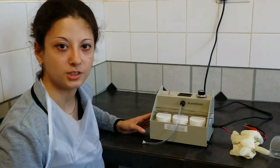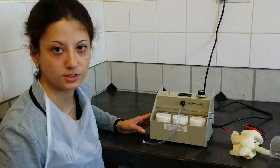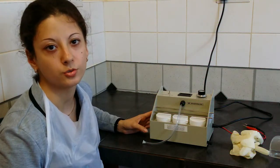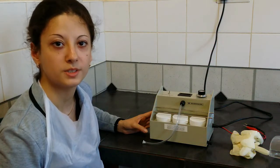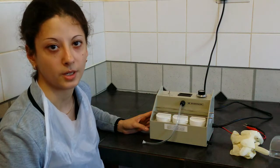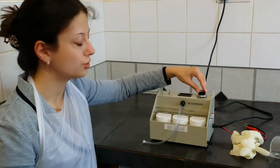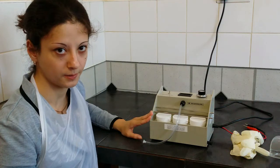Same as the majority of machines available on the market, our compact electroplating machine supports up to 12 volts power, and it also has an adjustable power control, which you can see here. Regarding the current, it can go up to 4 amperes maximum for a short period of time. However, if you want your current to be stable continuously during the process, you will need to set it to 3 amperes maximum. Please make sure that before you put the plug into the socket, you turn the power control to the furthermost left position anti-clockwise to ensure that there is no power supply.